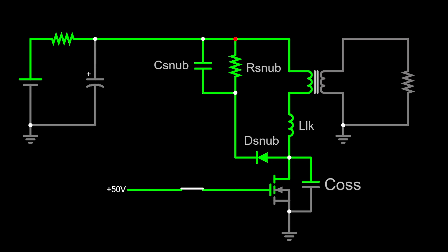These additional elements are inherent in some of our power stage components, and they arise from non-ideal characteristics of the components themselves. The first parasitic element comes from the transformer, labeled with the L_leak designator. This is known as the transformer's leakage inductance — the portion of the primary side inductance that is not magnetically coupled to the secondary side. Transformers can never actually attain perfect magnetic coupling efficiency, so some of that inductance leaks and is represented on the schematic as a separate inductor in series with the magnetizing inductance.